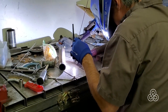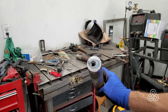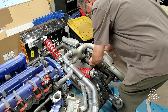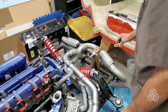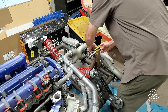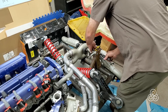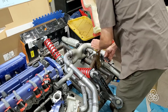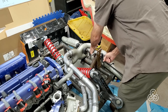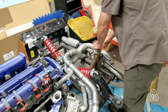Now once this thing's welded, I also need to go back and grind these welds off smooth back to the diameter of the tube, because that tube needs to slide between the two parts of the bracket. As it slides in, the sheet metal part of the bracket needs to sit perfectly level. That's going to hold the crash structure and also be the point where the rear clamshell comes down and seats on a couple of rubber mounts. To hold this all together, I'm going to clamp that sheet metal onto that tube. Got a little level on top, working to get that thing level, and making sure the bird mouth of the one tube is fitting on the cross frame on the subframe.